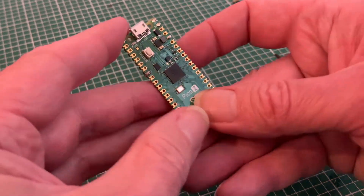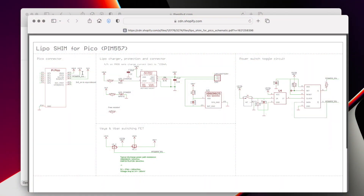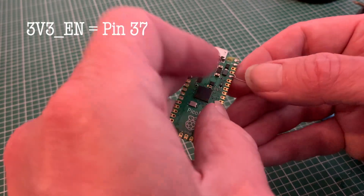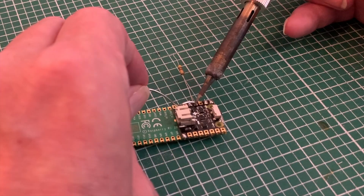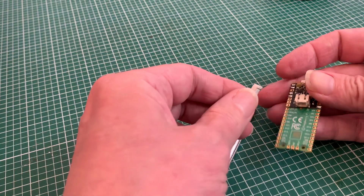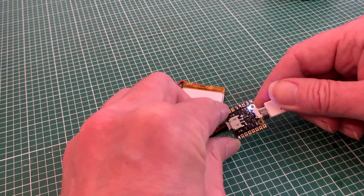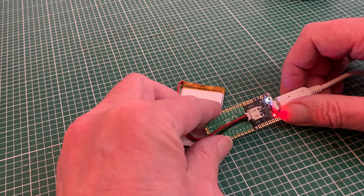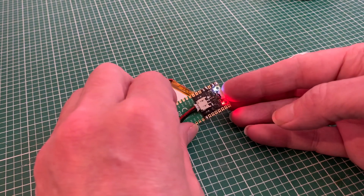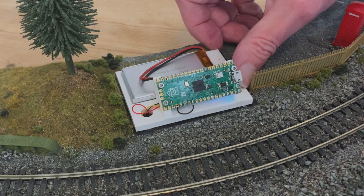I think that's it — I've got the two 5-volt inputs connected, the 3.3-volt output, and a ground. But looking again at the schematic I see that pin 37 is mentioned and it seems to have something to do with the power toggle switch, so I'm going to go ahead and connect that as well. With the resistor snipped off and put back in my box, I can plug in my battery to test the installation. The white power light confirms everything seems fine, and all good too for recharging — that red light will turn green when fully charged. Our power toggle switch is working too, so our caution on pin 37 has paid off.